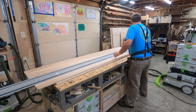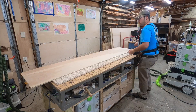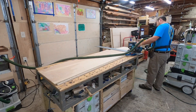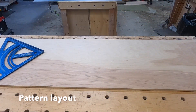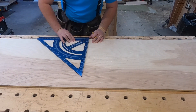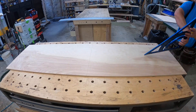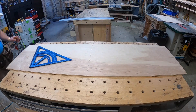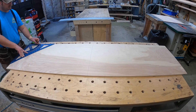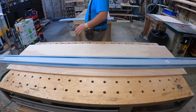To make this table I am going to basically be laminating the chevron to a half-inch piece of plywood. The total thickness is a three-quarter inch tabletop, and I'm using half-inch plywood as a substrate and I'm going to glue my pattern to that. What that'll do is keep it from buckling and moving, because if you do a chevron with all solid wood you have so many grain directions going different ways that the expansion and contraction will kind of rip it apart.